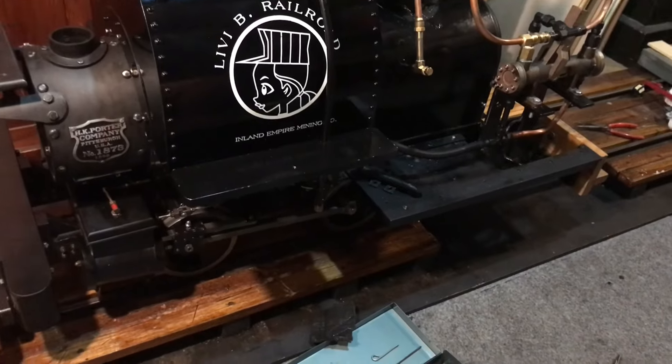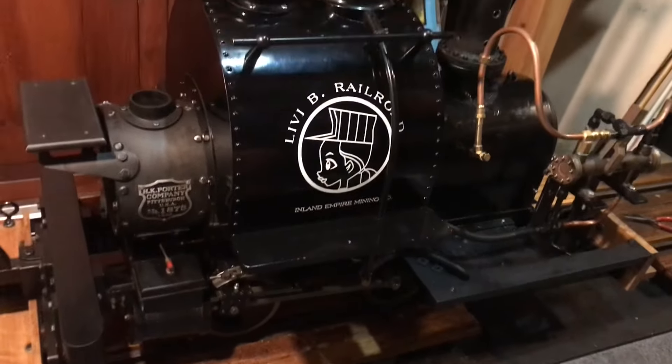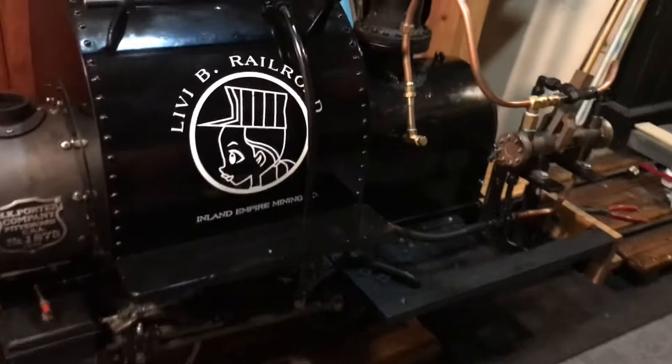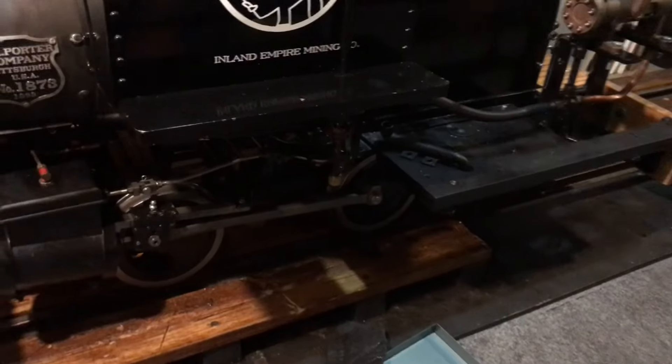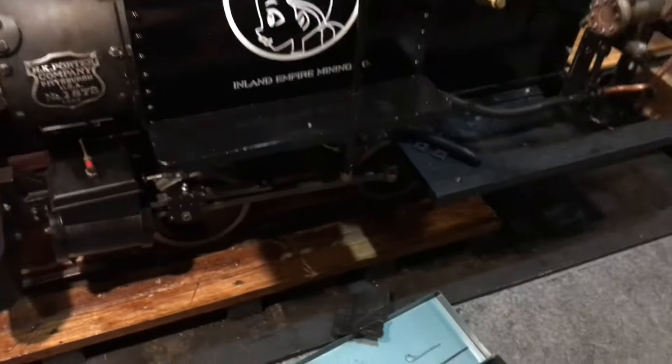So the jacket took a little bit, but it is on. And the saddle tank is on. I just filled the cylinder lubricator up. I'm going to drain it a little bit, let it ventilate any air that's stuck in there. From the reservoir up here to the cylinder lubricator down here, it travels quite a distance. So this little cap I'm going to open up, let it bleed a little bit, and just reassure that there's nothing but sweet honey coming down to those pistons.